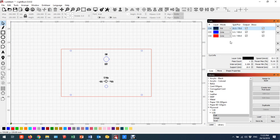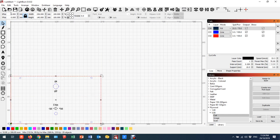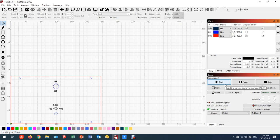At this stage I've managed to set up a cut file — I've chosen my order of cutting and engraving by setting the order of my layers. If I got it wrong and wanted to change it, I could use these arrows to move the layers up and down to change the cut sequence. Now I need to work out where I'm going to put my piece of wood. I've got the laser cutter set up so I can put a piece of wood right down on the origin at zero zero. I'll select everything, set my X position to zero and Y position to zero.